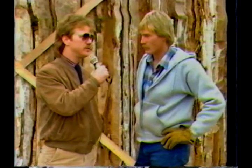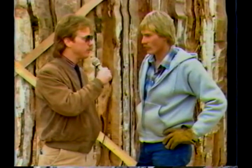What, it rotted out or something in the years? Yes, it completely rotted out. We're going to have to go back and piece it back in a little bit by a little bit. But the materials that were completely gone, are we just going to use newer wood or newer materials, or what? No, there was some other lumber in another barn right there beside the older lumber too, and we're going to go back with it. Okay. Some of the old-time dimensional lumber. The one piece that we are using is a treated lumber for the bottom plate, so that we won't have the problem with the ground rot on the bottom of it again.